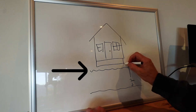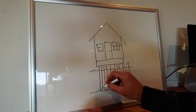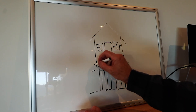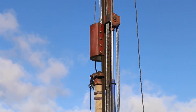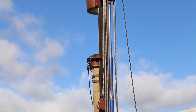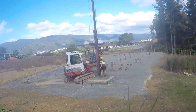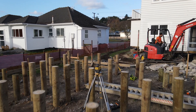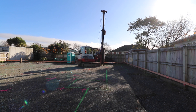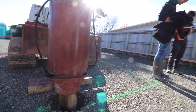The ground was up here but good ground was down here. The timber piles transfer the load from up here all the way down to there. There's going to be 72 timber piles under this slab on the townhouse job.